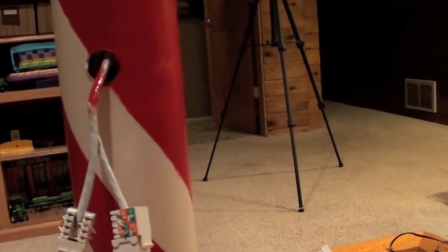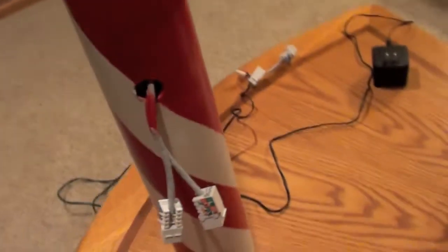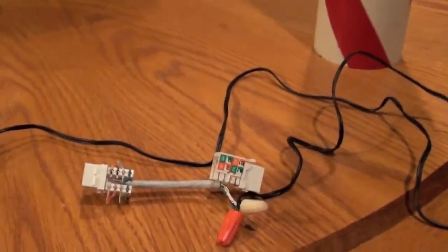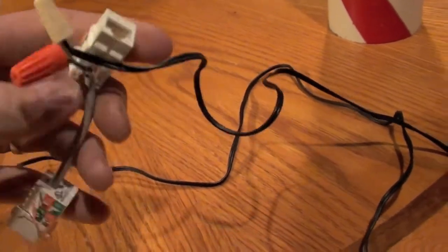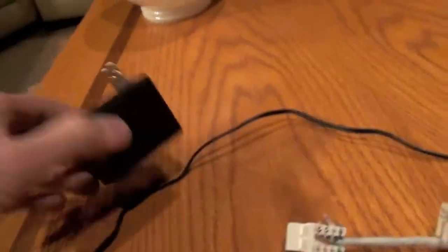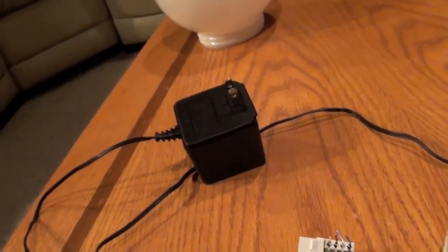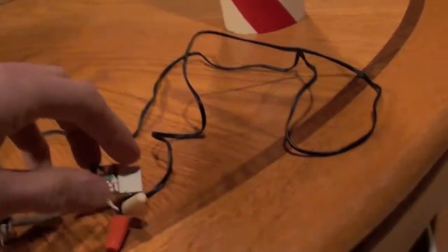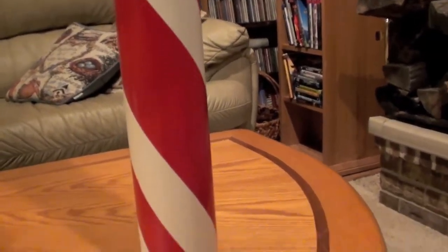The two jacks are identical. One will come in from either the adapter and the next one will go out to the next pole. The power injector is right here — on one side is a Cat5 jack where only the orange and white wires are connected. The other wires are hooked to a wall wart, which is just temporary. All the wires connect to the other jack, which merges the DMX signal coming in with power and provides both to the north pole. Then you chain them all the way down the line.